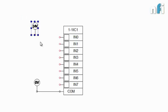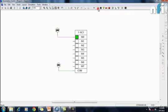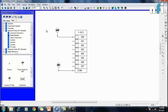Now, you have to understand that we need to create a potential difference of 24 volt across these input terminals. Only then will this PLC recognize that there is some input. For example, if I connect this 24 over here and then simulate, you will see this is on. This is on because of this 24 volt and the 0 volt, which is connected internally to this input. So we have created a potential difference of 24 volt. Now let me make this understanding clearer.